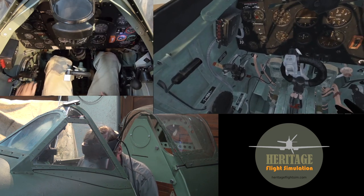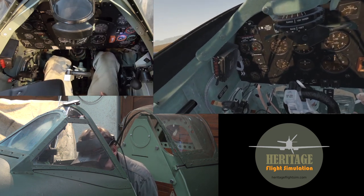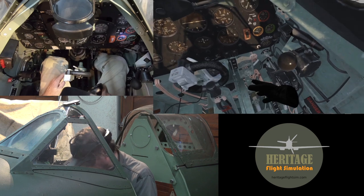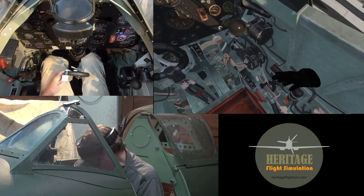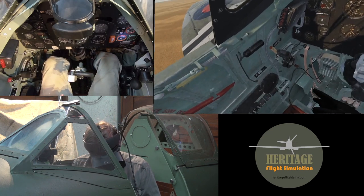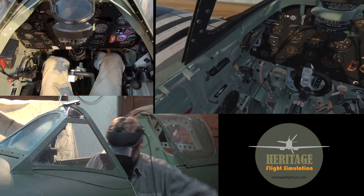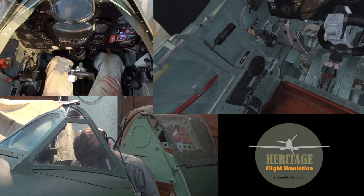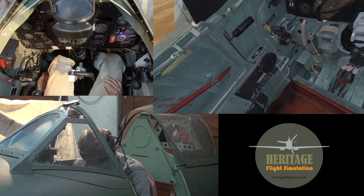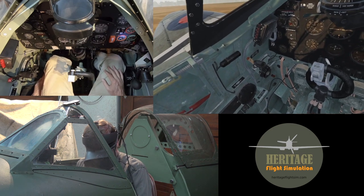Going to set the trim down. The switches are off, flaps are up and those are closed. Main fuel switch is off and we are looking good, so we can start the sequence. First of all we will start by opening up the carburetor air, and that is just so that the air is filtered when it comes through.